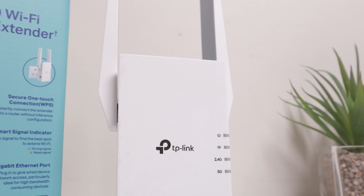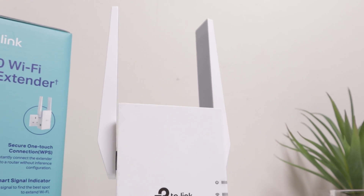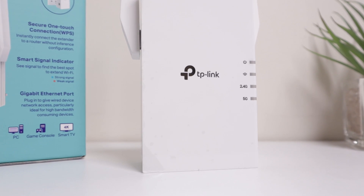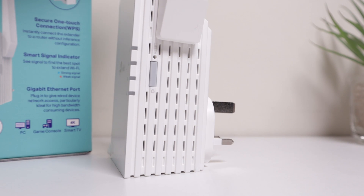Powerline adapters do work okay, but they're a bit temperamental at times. With powerline adapters you've got to make sure you're on the same wiring. My house is older, so I'm okay, but you've got to be on the same ring mains. And even if there's a little problem with the electrics in your house, the powerline adapters will not work.